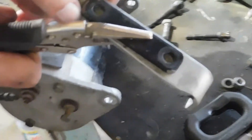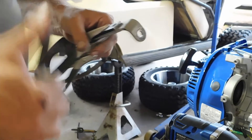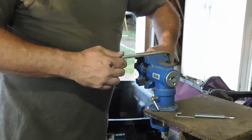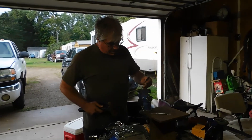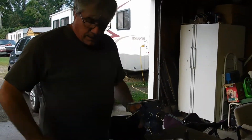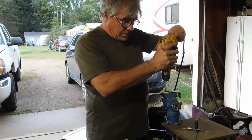There's where I put my holes. One of the best tools you can have in your shop is a Sharpie. Got my hole mark, got a little vise, a little punch. This is not the ideal way of doing it — I have a drill press, but getting the drill press out just for two holes... I need to get a bench set up where I can keep my drill press out all the time. This is what I call a pilot hole.